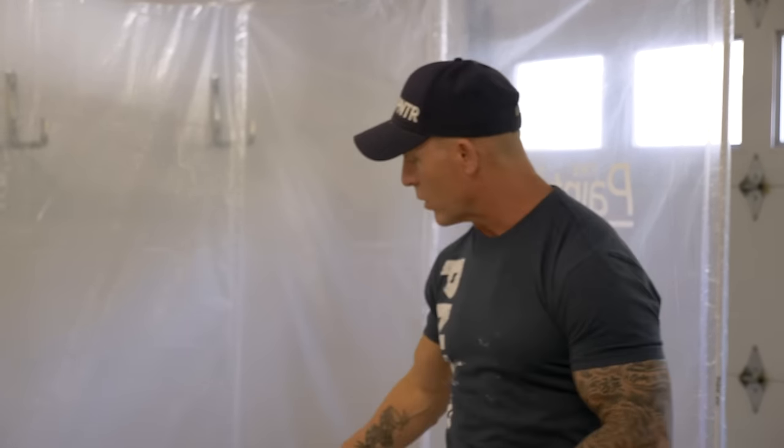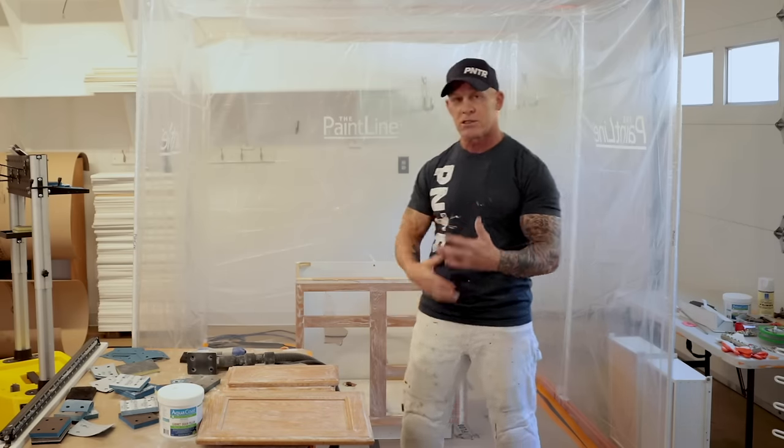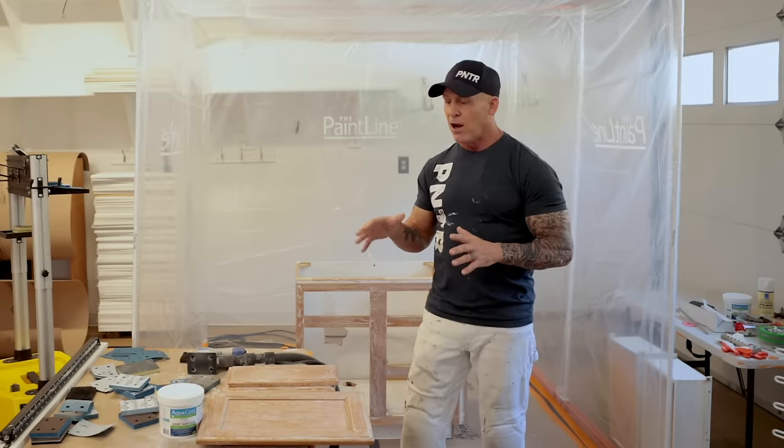We're using aqua coat on this cabinet door because we're trying to eliminate probably 90% of the wood grain effect, and the pinholes and dark shadows created when you paint something like this white. We got three coats of aqua coat, sanding in between. That takes a lot of time and effort. If you try to paint oak white without filling any grain at all, probably 90% of your customers are not gonna like the outcome of the cabinet.